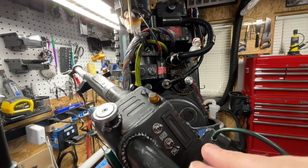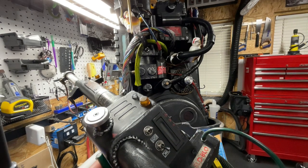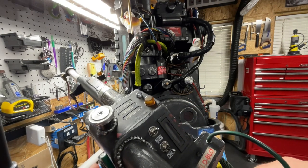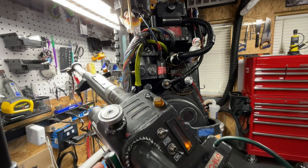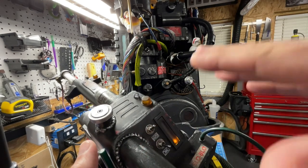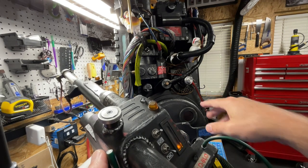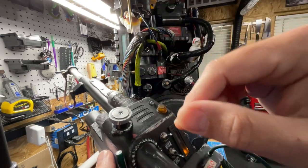Level one is a very special setting affecting only the inner cyclotron. Some users were recommended a certain type of LEDs for the inner cyclotron that unfortunately use GRB color order, which flips the red and green values. You can toggle between GRB and RGB mode here. I left mine as RGB inner cyclotron with 35 pixels, outer cyclotron at 40 pixels, and power cell at 15.